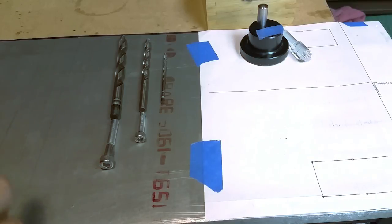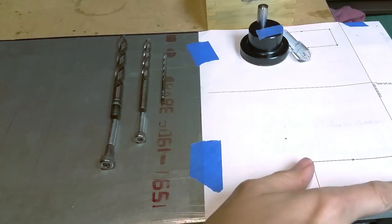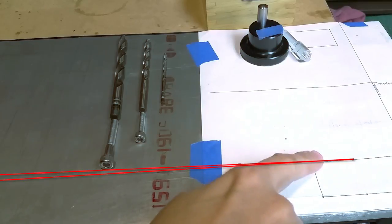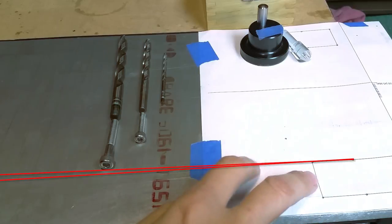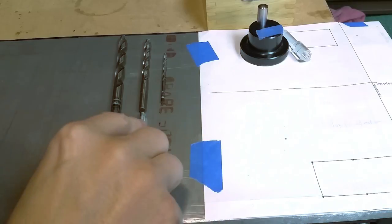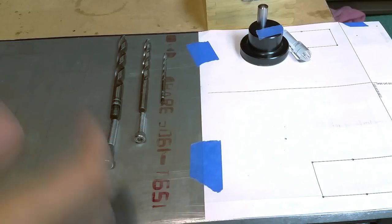And once again, the point I'm trying to drive home is that when building something out of imprecise things, we pretty much have to make it adjustable. I don't have high precision machines to make this out of, and so I need a little adjustment here and there. If these are off just a little bit angular, that builds up quite a lot over the distance of over a meter, or about 3 feet. And so that little bit of difference isn't that much in perspective.